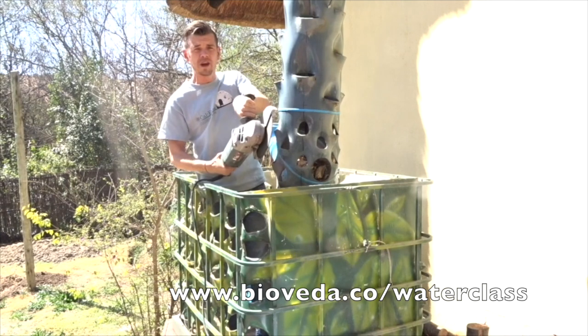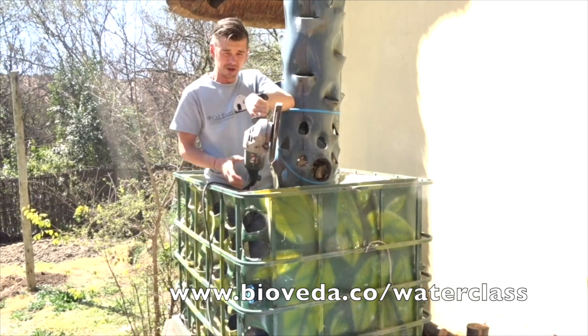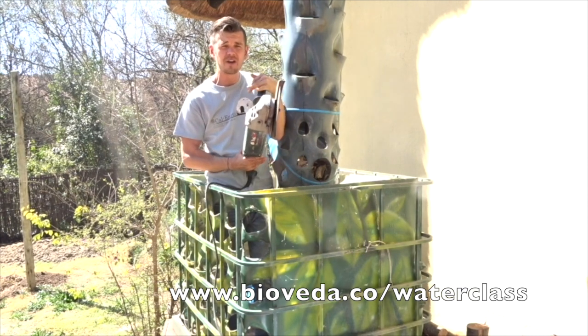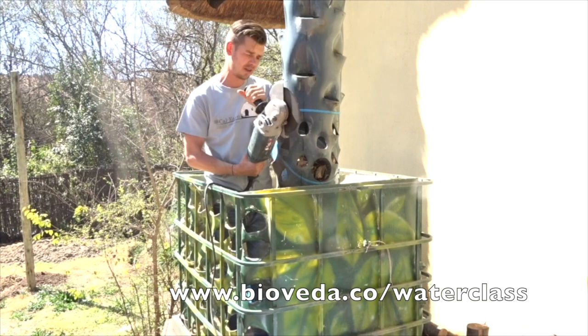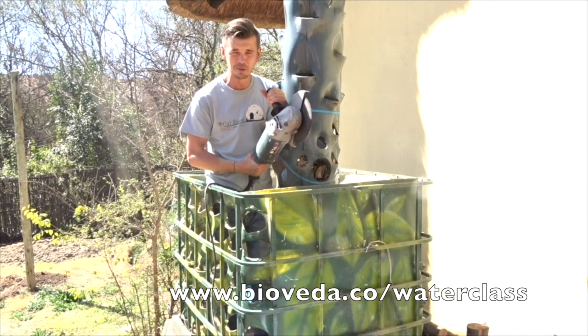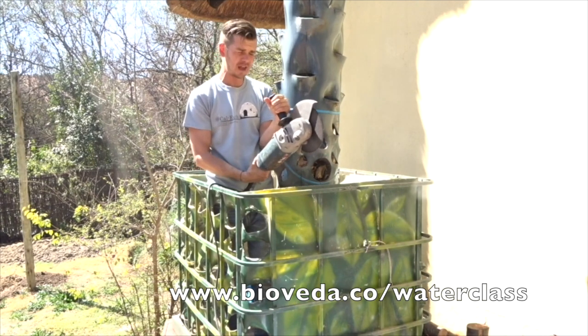Make sure you've got it steady. Whenever starting the angle grinder, always start it like this, because if the blade is broken, or if you left it somewhere in funny places, the blade could split in all directions at a lot of revs per minute. So always start it away from your face like this, because you've got this protection.